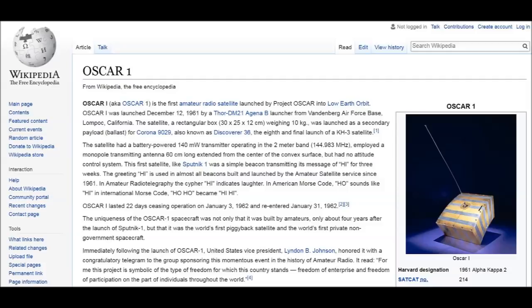A bit of history. Amateur satellites have been around since the 1960s, first as beacons and then as repeaters. The early repeaters were all linear translators — transmitting a slab of spectrum from one band to another, often from 2 metres to 10 metres or 2 metres to 70 centimetres. They typically required expensive equipment and antennas. More recently, we've had a profusion of low-Earth-orbiting FM satellites.